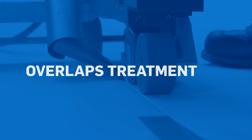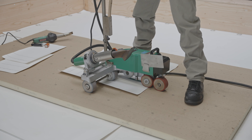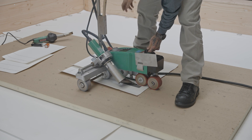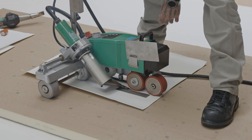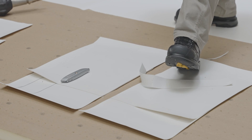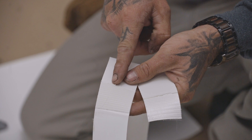Now let's see how to treat membrane overlaps. The use of a welding cart and an electric hot air welder will be required. We recommend that you perform test welding each time your welding equipment is stopped and restarted, or when there is a change in climate conditions. Turn on your device and wait until it reaches the desired temperature. Use membrane scraps and weld them together. Once the sample has cooled, pull the two pieces of membrane apart. A satisfactory weld is produced when the PVC uniformly delaminates from the reinforcing fabric and has a minimum width of 38 millimeters.